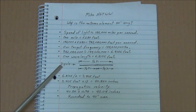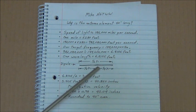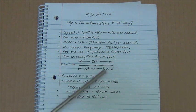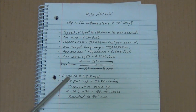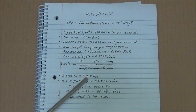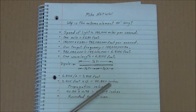The dipole itself is basically one half wavelength — the active element is one fourth of a wavelength and the counterpoise is one fourth of a wavelength. So if we took one wavelength at 6.8105 feet and divided it by two to get our dipole length, it would be 3.405 feet. If we took 3.405 feet times 12 to give us inches, we would have 40.860 inches.